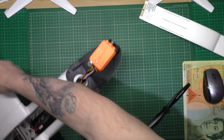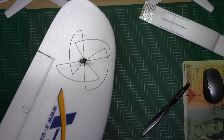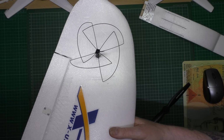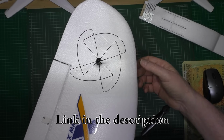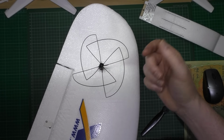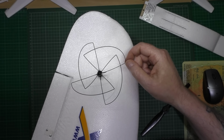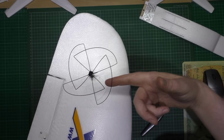I've also got, when I can get it in shot, these big nose 1.3 antennas. I urge everybody to go and drop Simon an email, just get one of these to try, because they far beat the Fat Shark and everything else that I've tried. I know this is 1.3 or 1.2, but with these things you don't get any multipath, or very, very little multipath. I'm really, really surprised at them. So drop Simon an email, tell him I said.